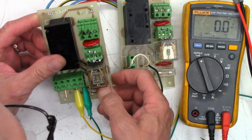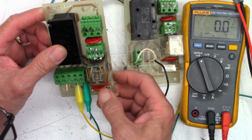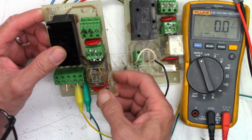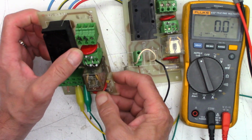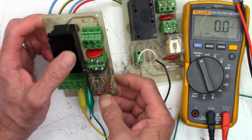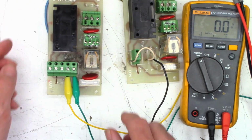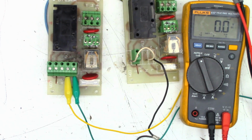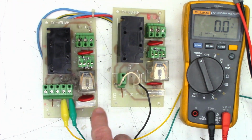What about the possibility of a date code on one of these metal oxide varistors? They are 250L40s. And the only date code I might see on it is H and then E0. But yeah, that's going to be it. The boards appear to be working, minus the defective fuse holder, or under-tensioned fuse, I should say.